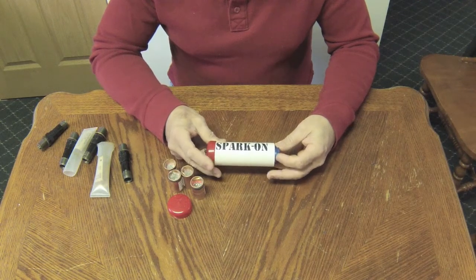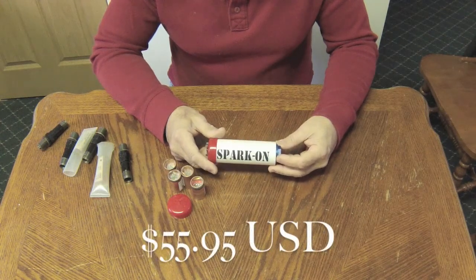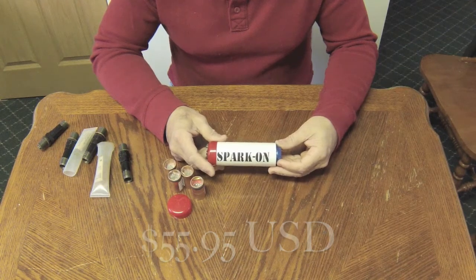It's very easy to have in your toolbox and available on csobeach.com for $55.95, which includes shipping and handling via USPS Priority Mail with delivery confirmation. If you've been doing your spark plug resistance checking with your voltmeter and the test leads associated with those devices and found that to be a little cumbersome — I hear you, been there, done that. This little tester looks like a very cost-effective product for your toolbox, and might even make a great gift for your A&P IA for testing spark plugs on your aircraft and others they're working on.